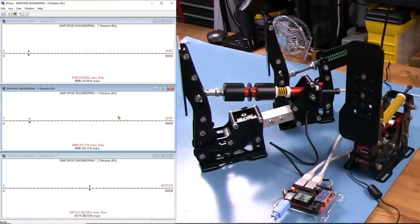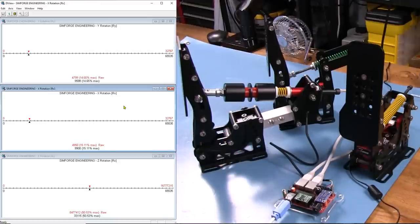So what we're going to do now, now that we know the filter works, is see how it affects the resolution. Does it decrease it? Does it increase it? I would think it would decrease it because we're clipping off some of the wave. That's what filtering does. It clips off some of the wave so that it smooths things out. So I'm going to go ahead and see what we have for resolution. And this is only 1. It might affect it more if I go all the way up to 5, and we might test that too if there's nothing going on here.